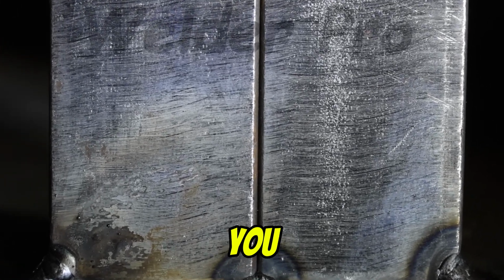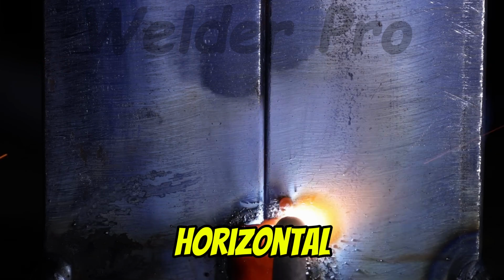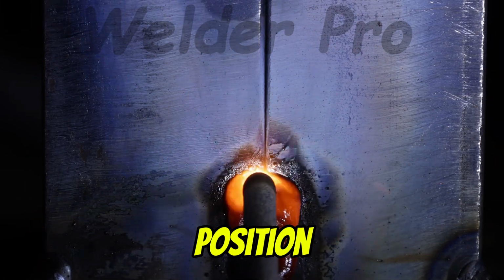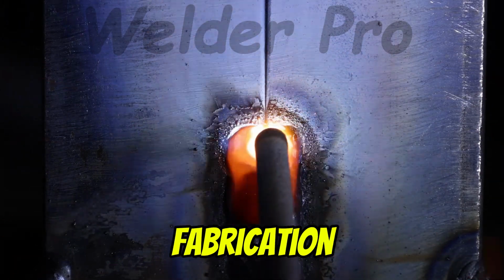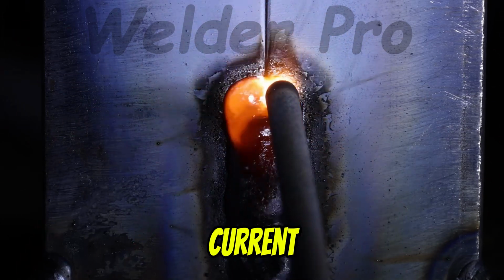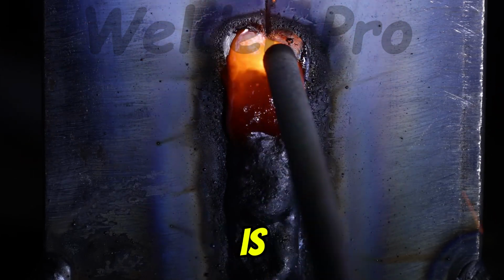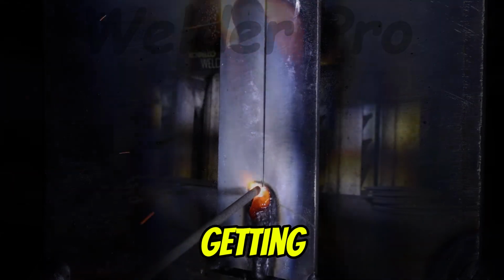Today we're going to walk you through the step-by-step process of manual stick welding two vertical and horizontal metal plates. This setup is known as the 3G welding position, and it's an essential skill for anyone working in welding or metal fabrication. We'll be using a Kaynak 56S electrode with a current setting between 90 and 100 amps. The electrode is 2.5 millimeters in diameter, which makes it a great choice, especially if you're just getting started.